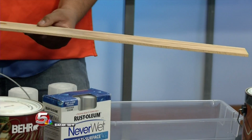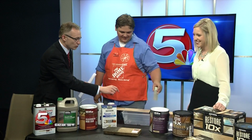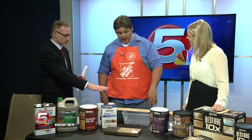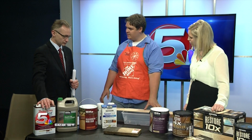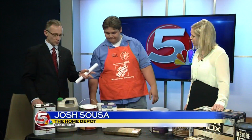When I'm buying the wood for my deck, if I were going to build a deck, I can buy the wood treated already, pre-treated with stuff. Do you recommend that or no? It depends what you want to go with. A lot of people are going with a composite decking, but you can buy a treated wood. It's not going to be treated the same way as this. It's going to be just treated to reduce mold. And you'll want to continually use maintenance on that with a stain that's going to penetrate that wood again, because the basic treating on lumber is just to keep it from molding for the most part for the first couple years. So you got your wood ready to go.